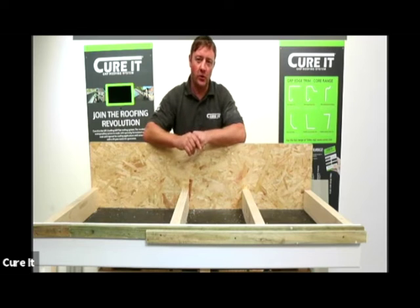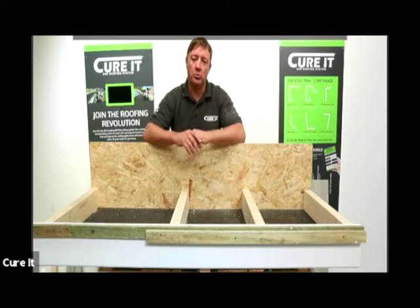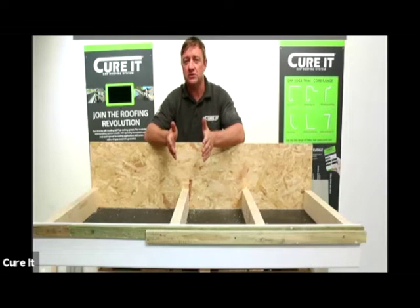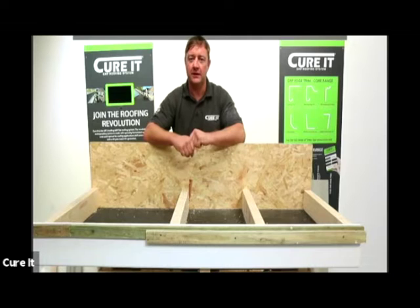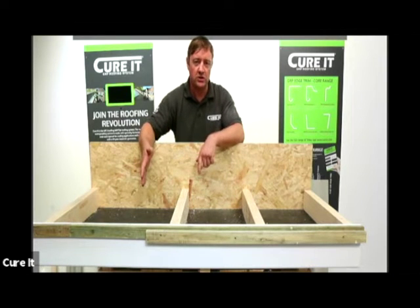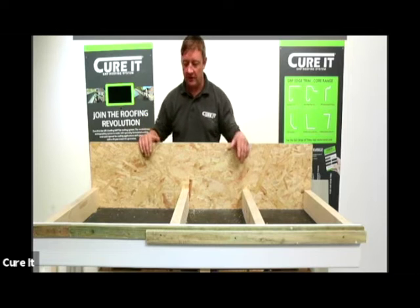If you're doing a 180 square meter roof, we'll look at putting one expansion joint down the middle. Bear in mind the drainage points for expansion joints - we've got to make sure they don't obstruct any drainage. We need to look at both the drainage and the actual structure when we position your joints. It could be where you've got existing joints, or you could be putting new joints in.